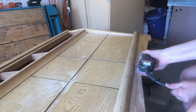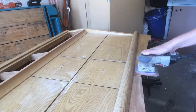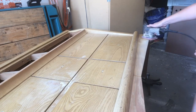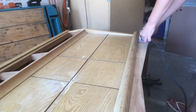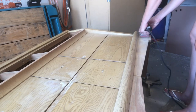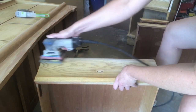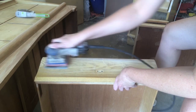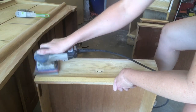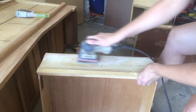My original design idea on this is to leave some of it natural wood and paint some of the other parts. So I'm going to start sanding what I think I want to leave as natural wood to start with, and that includes this base. Some of the drawers are going to be left in this beautiful natural wood tone as well, so I grabbed my Surf Prep Sander 3x4 Ray with the squishy pad attachment, and it just goes into all these corners and curves really beautifully to get the project down to bare wood.